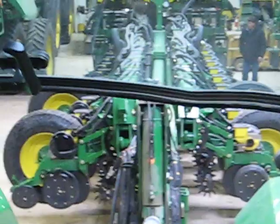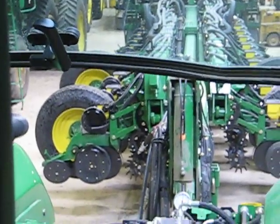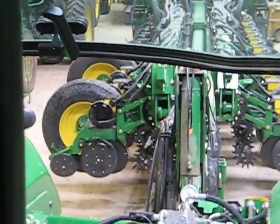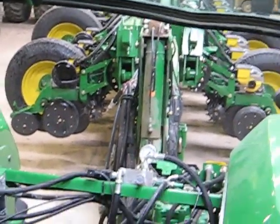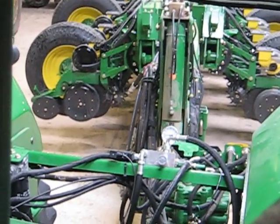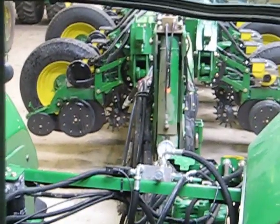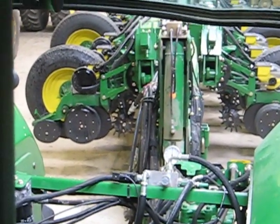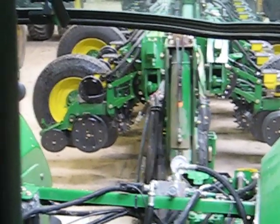Let's take the SCV valve and go back to float. The SCV valve goes back in float — the pressure is still on. There we go, now it'll come up. Now go back to on. It all comes down. See the pressure in the gauge going up a little bit. Then back to float — units all come up.